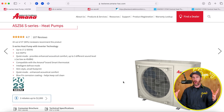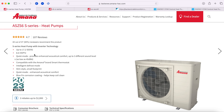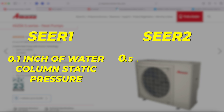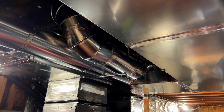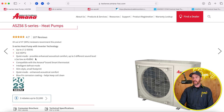Looking at a broad overview of specifications: this system is rated up to 17.2 SEER2. For those just starting their search, we recently phased out SEER1 equipment. The difference is that SEER1 was tested at 0.1 inch of water column static pressure, while SEER2 is tested at 0.5 inches of water column total external static pressure — a more accurate, real-world rating. As technicians in the field, we rarely encounter ductwork at 0.1 inches WC; most ductwork is undersized or minimally sized. The HSPF2 rating is 8.6 — that stands for Heating Seasonal Performance Factor, which is the biggest selling factor of these side discharge systems.